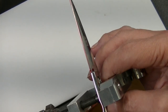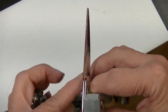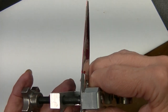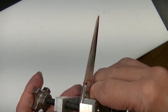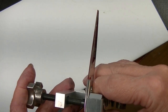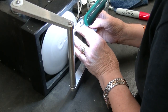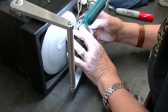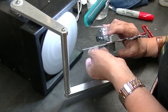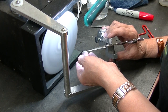Do you see where the red sharpie mark has been removed and where it still stays behind? There's red right along the edge which tells me that the angle on these shears now is less than the angle I've been sharpening at. So do I go down to 40 or do I leave them at 45? I made the decision to leave them at 45, and therefore I needed to use a more abrasive material, and I'm still having difficulty getting a burr.